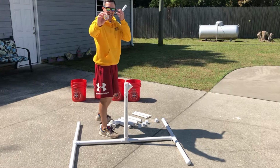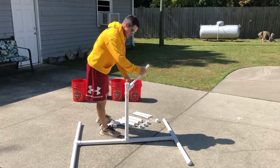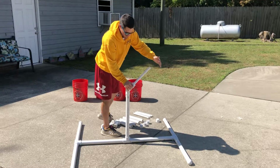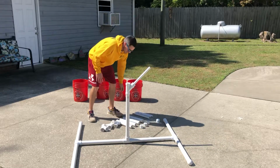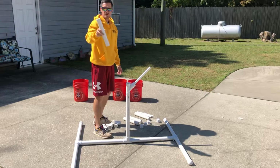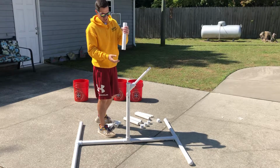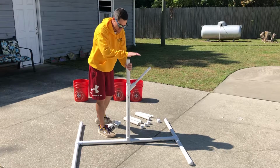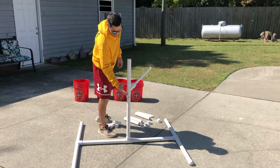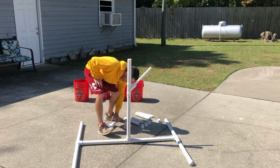We're taking our 1.5 to 3/4 inch filler, we're popping that inside the 45-degree arm, and then we're taking our 3/4 inch 1 foot, and we're popping it right in. Next, we're taking our first 1 foot, 12 inch, you can go 12 to 14 inches, 1.5 inch PVC pipe, and we're just gonna start building up our tower. And we're gonna repeat what we did down here. So we've got our 1 foot, 1.5 inch PVC pipe. We've got our elbow.